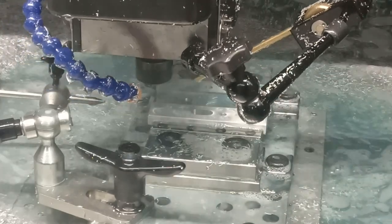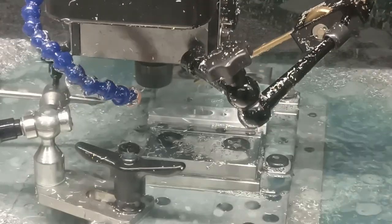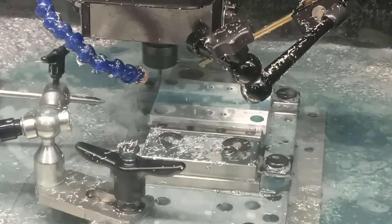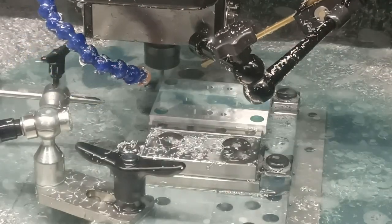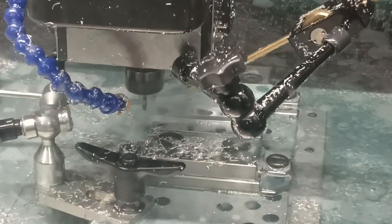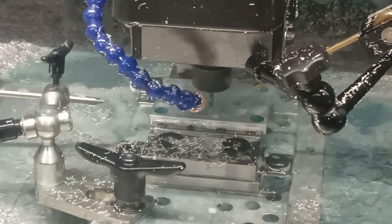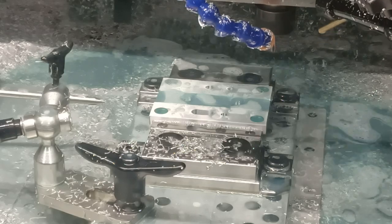I always cut the parts with a little extra, so if I'm loaded a little bit either way I'm good, then I machine both sides. This part is 4 inches overall because those vise jaws are 3 and three quarters — if I make sure I design the part just bigger than the jaws, I can machine both ends as well as the top. I also designed this part to have no machining on the back side, so I can do everything in one program. Also, don't do tool changes — tool changes suck a ton of time. I'll do all 50 parts with this tool, then all 50 parts with the next tool. Langmuir has a video showing you swapping a tool in one minute — guys, that's not realistic. It's going to take more than a minute to swap and reset a tool, and why enter extra variables into the process?